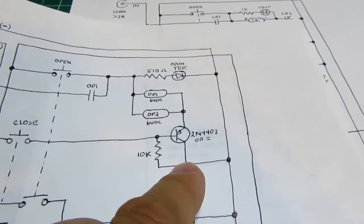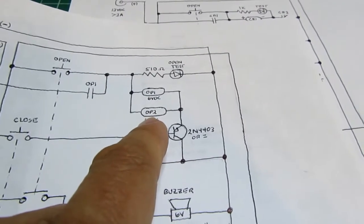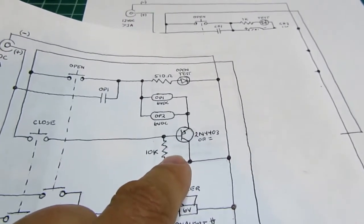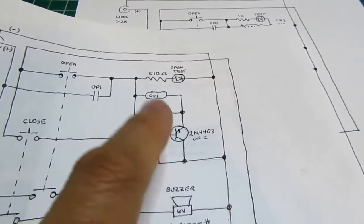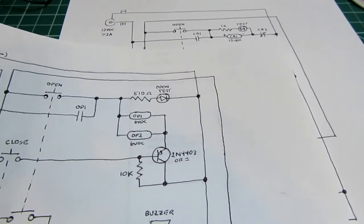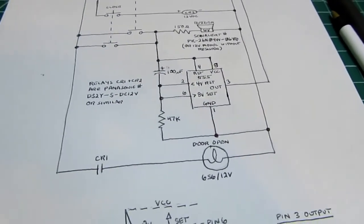in practice, when I built the circuit for real, the voltage on the relay coils was just a little bit too low for them to pull in reliably. Sometimes they would, sometimes they wouldn't. So that circuit either needed to be enhanced. I could have done it with a two-transistor circuit. I maybe could have reorganized this in some way to make it work, but I decided it wasn't worth the headache, and it was easier to just reorganize CR1 to do two jobs and have CR2 handle the inversion and reset function. Otherwise, the 555 timer circuit is identical, and the rest of it works the same.